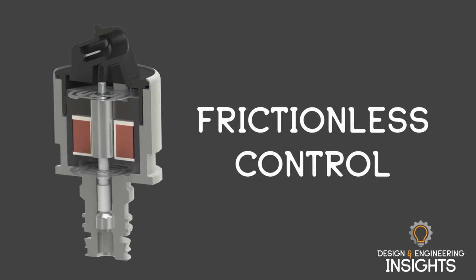So when the solenoid or the valve is powered, that creates an electromagnetic field, and the armature in turn can move based on the force that's generated from the motor, and that armature is essentially suspended inside the motor. The benefit of that is the radial gap inside the motor allows for frictionless control. So the armature, which is the only moving piece in the motor, has no surface-to-surface contact. And with that, that allows for a very repeatable output for a pressure control valve.